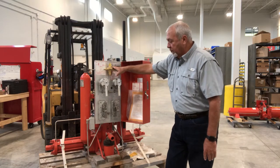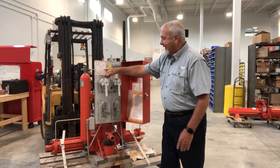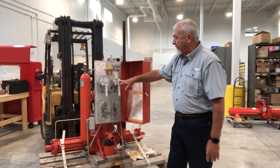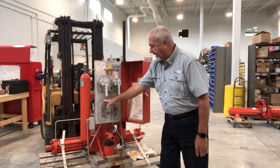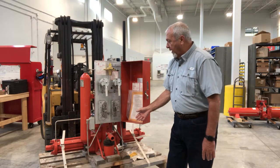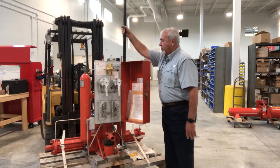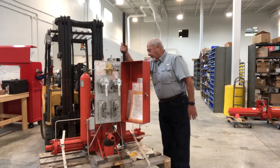You do not need it because this will take high-pressure gas and cut it to the appropriate point. What you're going to find inside is two pneumatic control devices. Both of them are clearly marked — this is closed, this is open. And you're going to find two hydraulic operation points. This is from manual override operations where for some reason you don't have gas supply. Then you have your pump operation here, and the handle to pump that is located beside the door.